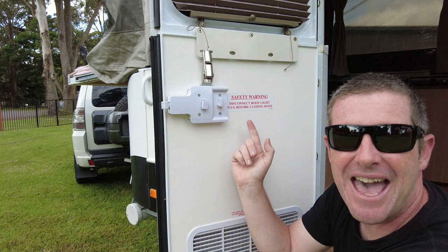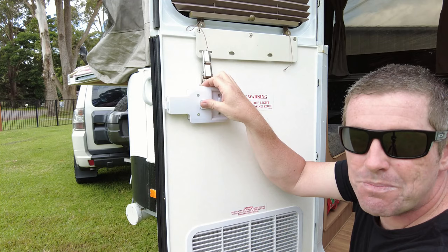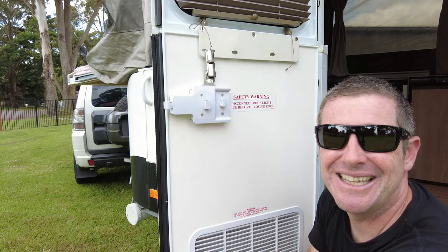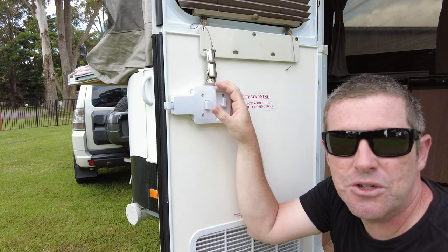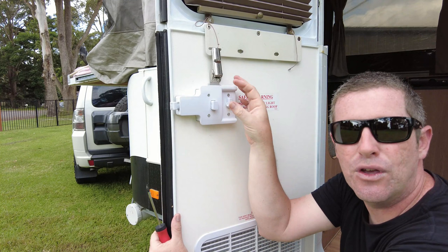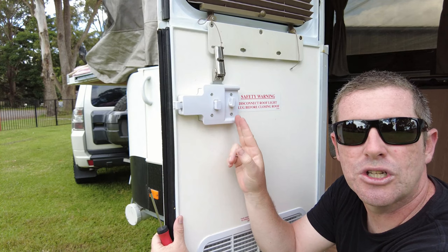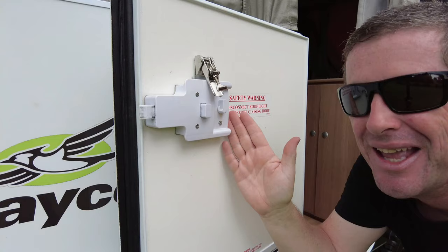If the door opens, you'll see the four mounting screws that attach through the door and secure the outside mechanism onto the internal mechanism. One thing that actually binds these push buttons up is that people do up these screws way too tight, which deforms and pushes the plastic together so the mechanism can't push in and out freely. So the first thing I would do if you've got a sticky mechanism is to loosen these off a little bit and see if that makes any difference to the operation. From there, you want to look at lubricating this, and we'll go inside to run through that.